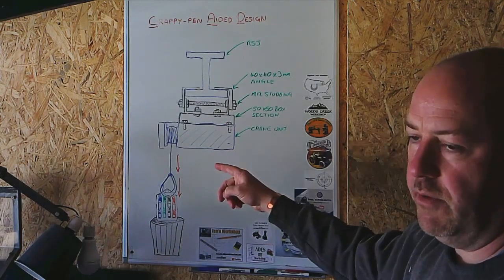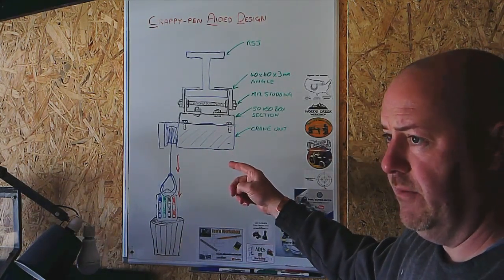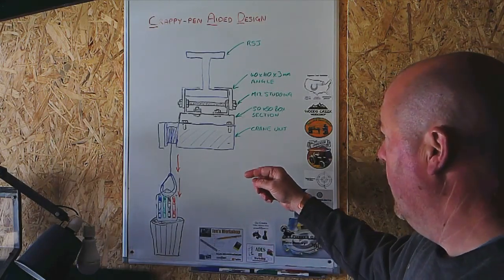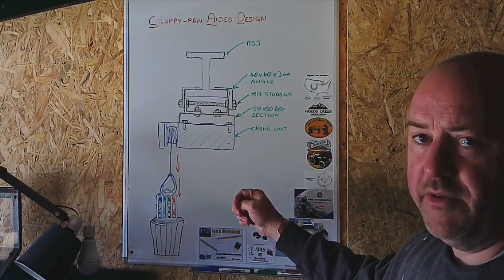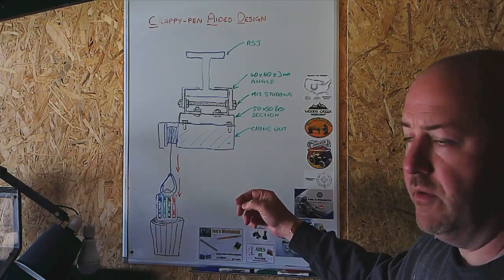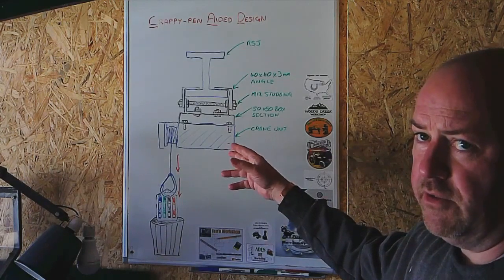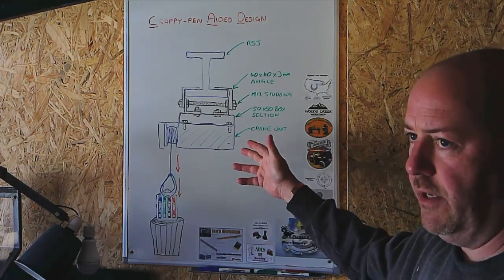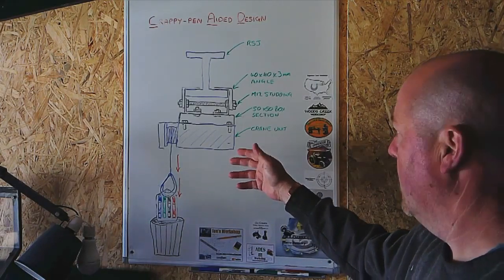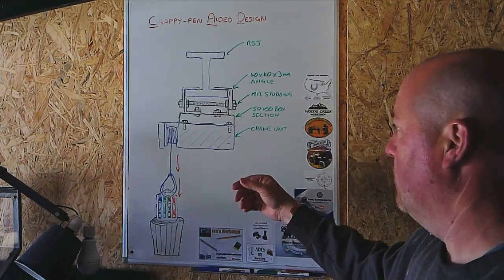and probably you'll see when I construct the bench, which will be welded, that my welding skills leave a lot to be desired, really, and probably would be perfectly well at home on top of the town hall underneath the rest of the pigeons. So I've decided to go for a bolted design, because it's going to be load bearing, and at least that way I can see the joints. I know they're strong, and I'm not reliant on some weld that may not be as strong as it should be.